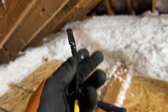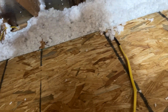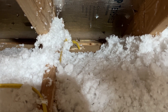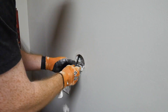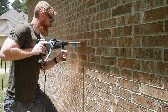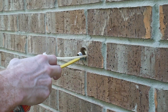Up in the attic, I have the wire attached to my metal fishing line, marked at six feet with green tape — exactly where the disconnect will be on the wall. I cored a 3.5-inch hole in my sheetrock across from where my exterior disconnect box will be, which will help me pull wire down from the attic and through the smaller 1.25-inch hole I drilled into the brick using a hammer drill. From an order of operations perspective, it's easy to forget to put the clamp onto the Romex before installing your disconnect box to the wall — if you do, you'll just have to take the box back off to install it.